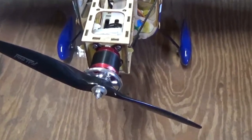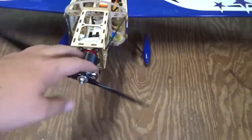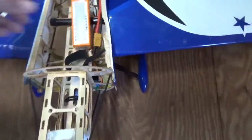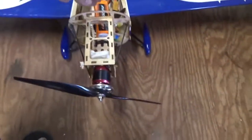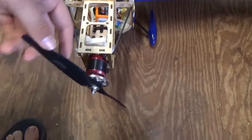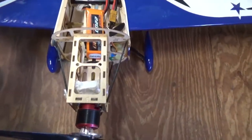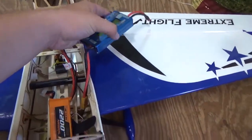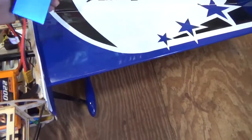So we have the Torque XtremeFlight motor on with the Falcon 12-6 prop. The ESC, in case you're wondering, is a 45-amp Airboss. This test will be on 4-cell, and my testing rig is the plane with no cowling or anything. That shouldn't throw the readings off too much. We'll change out props, and if we get more thrust or watts, we'll know we're producing more power and more amp draw. I'm using the HK010 — it's got a very nice watt meter built in and I definitely recommend a good watt meter for this hobby.